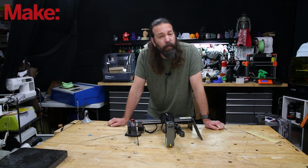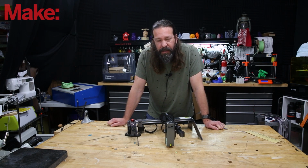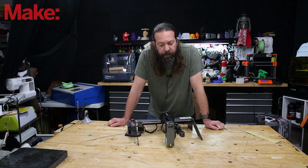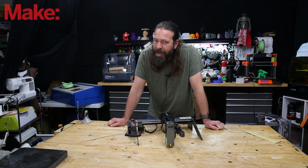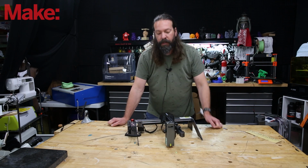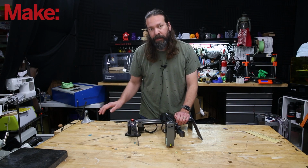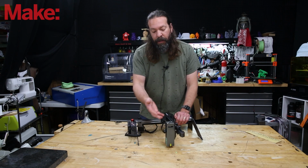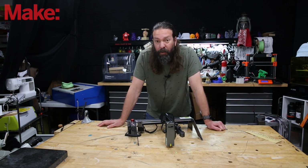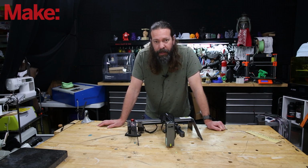Diode lasers are somewhat weak when compared to a CO2 laser or a fiber laser. Now, like I mentioned, laser wattage is a tough thing to use as an example, but it's really the only number we have. One thing you need to be fully aware of, though, is the nasty habit we've been seeing coming out of diode laser companies: they will market a machine such as this as a 50-watt machine, but that's including the power supply in all of that, when actually the diode laser for a 50-watt machine might only be 6 watts or 10 watts or 15 at most or something like that. It is a nasty habit. We hope they stop doing it because it is misleading.